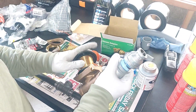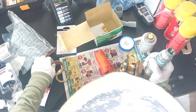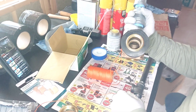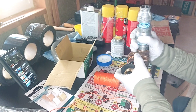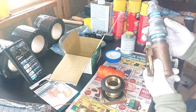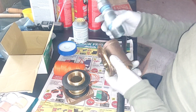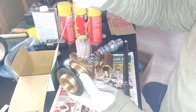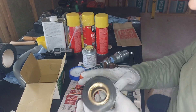On the other side, I am going to install this rubber, and then the other two parts — this and this. Then I can connect the poly pipe to the casing, and then I will remove this part. Here is going to be the rest of the poly going down to the pump. It is not complicated. This is going to be secure. I am also securing this part because I do not want it dropping inside the well, because I will not be able to retrieve it. So I am going to hold it like this until I am done.